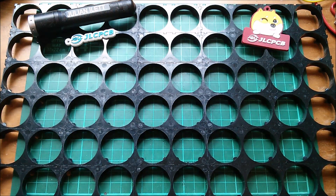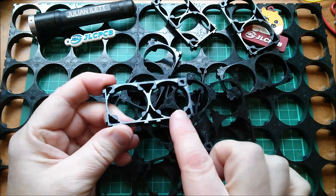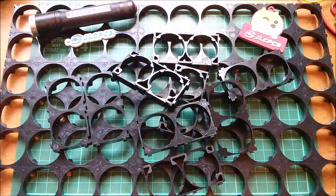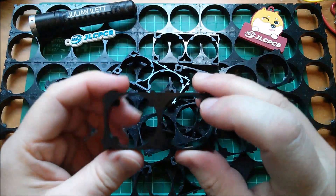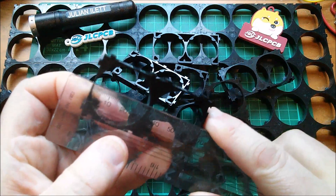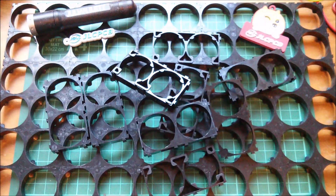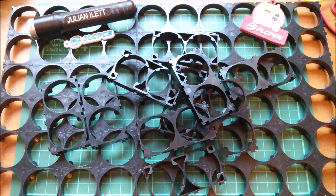Good morning. I've bought some cell end caps — and some more here. They're not 18650 end caps; they're actually 32650 or 32700, whatever length you happen to have. I've been waiting for these particularly because I want to know the dimension between battery centers. Measuring from that edge to that edge, it's not 32 — because of the slight gap between cells — it's more like 34.5 millimeters.